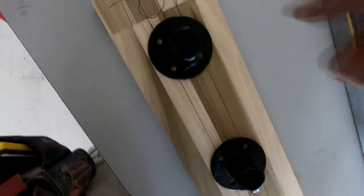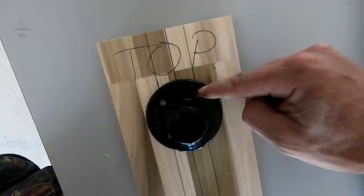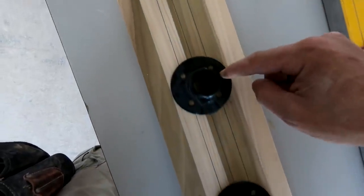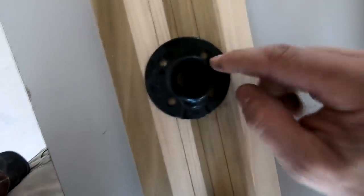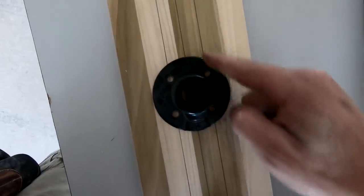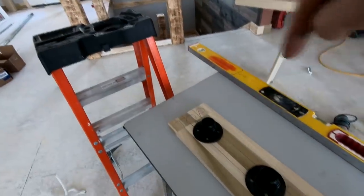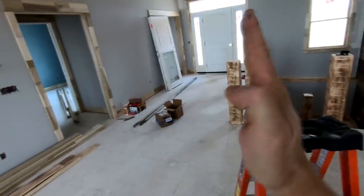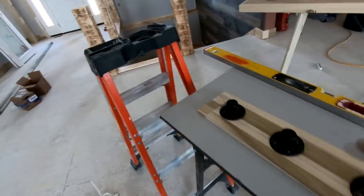So in review on our jig: we have the top of the jig marked, we've got a center line and two lines on the side which represent the holes for the floor flange — which is what this is technically called. I centered the hole on my center mark, lined up these holes so they're right where they need to be, drew the circles, and now I'll take a drill bit and pilot drill these holes. That way I can just put the jig up against the post and drill all 20 of those holes lickety-split.